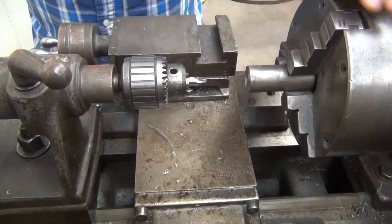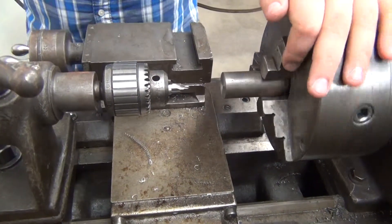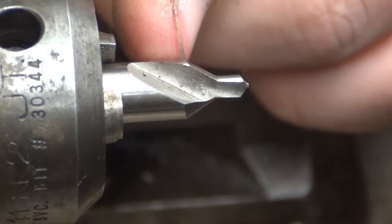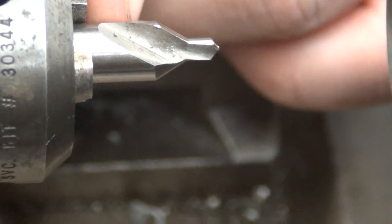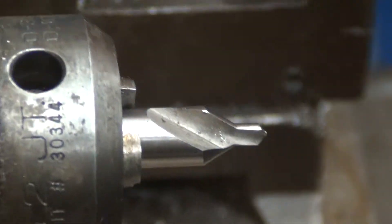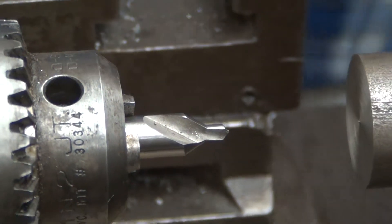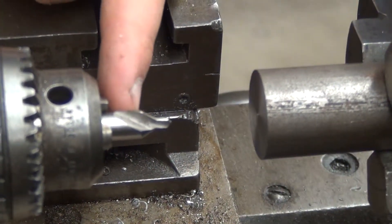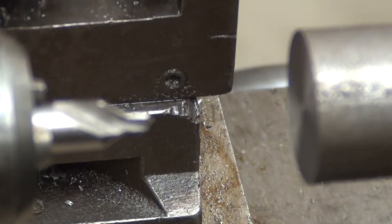I'm going to turn it on. Make sure it's turning in the right direction — if it were on reverse it would not work with this drill bit. So I turn it on forward and feed it in. I'm only going to feed it in about three quarters of the way up the angle. If I feed it past the angle and start getting into the flat spot, the live center is no longer going to seat on the angle — it'll hit the flat spot and won't seat well or be exactly centered. I just want the angled portion cut in there.